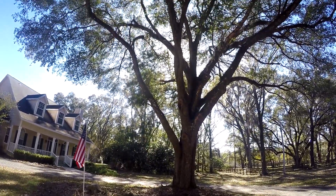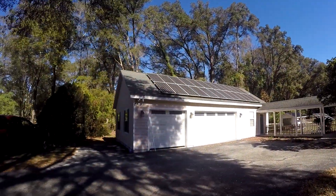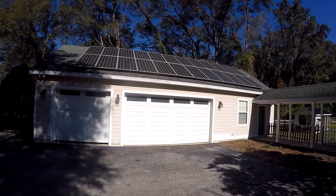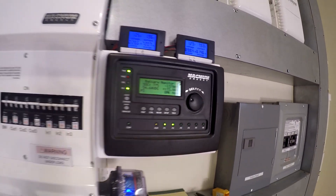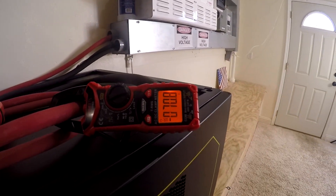It's 12:15. You can see where the shade is just starting to hit the panel — probably in only an hour or so this panel will be wiped out. That's because we're in January. We've got about 9,000 watts coming in, 134 amps going into the bank, 77% charged — about 70 amps per leg.